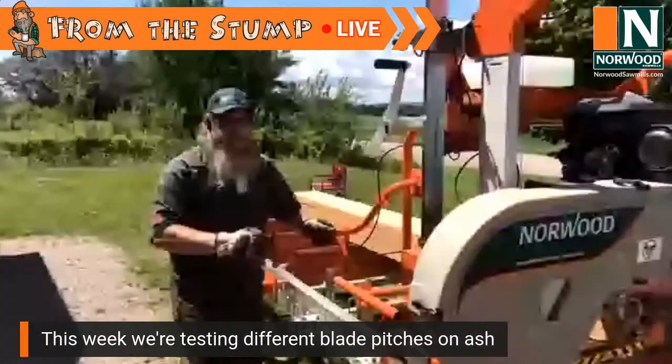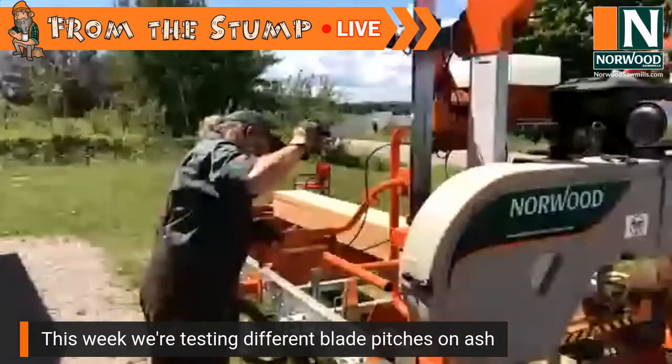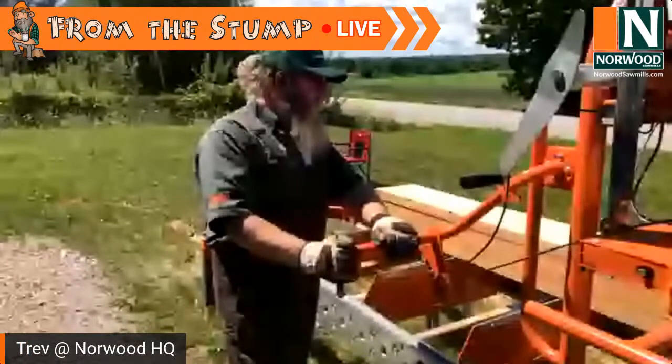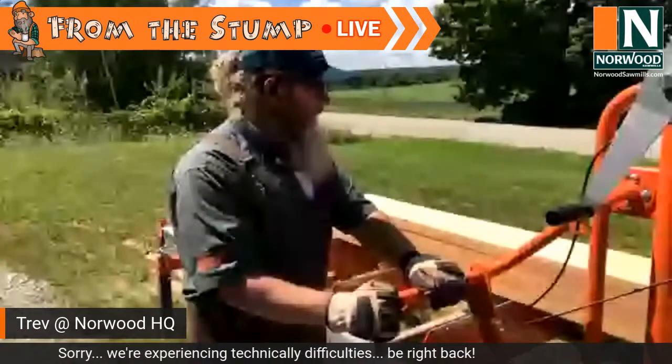All right, we made it through the cut and I'll give you some feedback because I know you can only see so much on the camera, but that was a pretty tough push. Definitely some different feedback versus when I was up here. When I started getting into this tension section, you could definitely feel some vibration in the head, like it was really digging in. And I had to definitely give it a little bit more pressure to maintain a proper feed.